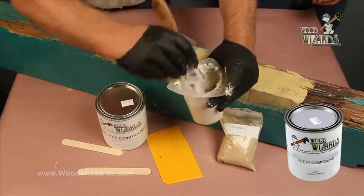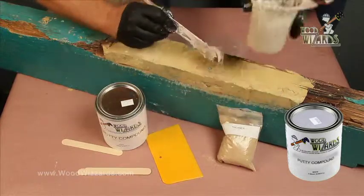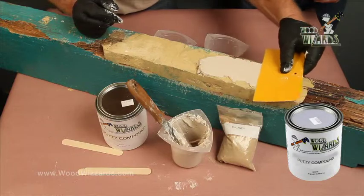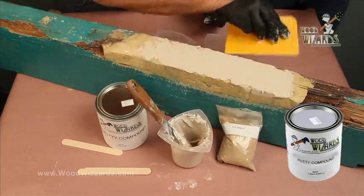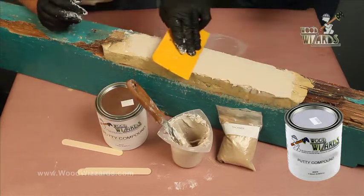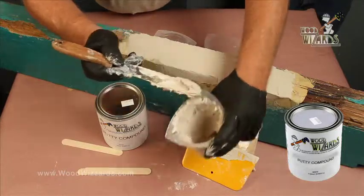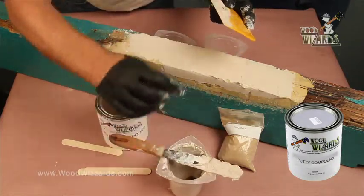Now we're going to spread it over the area we just fixed with the Wood Wizard to pick up any of those small voids. A little bit over here and we're going to take the spreader and simply spread it. It'll spread easy. Oh, that's just so smooth — just like icing a cake, just like you're buttering a cake. And we've done this all in this time, no elapsed time here. Can you do a repair in a day? We can get a job done in a day and so could you. We're going to put some along the front here as well. This time we're going to add some to the blade, and it's important to keep this edge clean so you don't pick up dirt and debris.